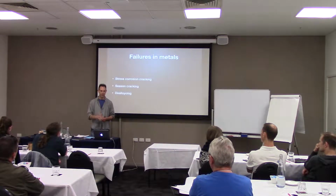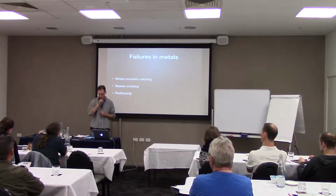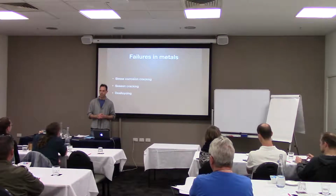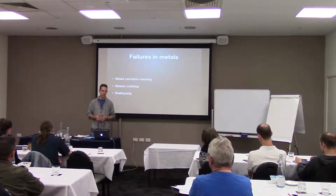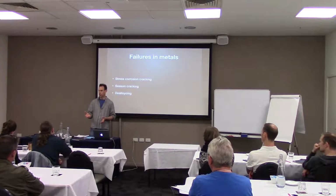I usually use the Miracle Cloth, or you could use buffing. There's a really good piece of literature written by James Moss. He's a clock conservator, and they do conservation on clocks from Roman times, on brass that has lasted that long. He was having a problem because even in the teachings on how to clean and conserve, there's an ammonia solution. And what they were finding, they'd come back a couple of years later and the arms on these clocks were cracked. So they had actually caused the breakdown of the grains. In my own shop, I have an old bell that I know I used Brasso on years ago, and I was looking at it the other day, and it's got little fractures right at the rim. I swear that must be from what I was using, and that scares me.